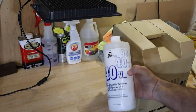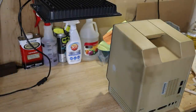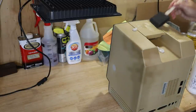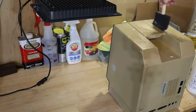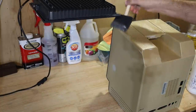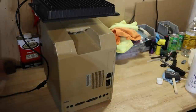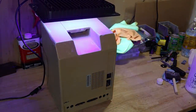The case is too large for immersion, so I'll have to use the cream method instead. I don't like this technique as much because it can lead to streaking and marbling. One way to mitigate that is to check on the part often, shifting or reapplying the cream as necessary. I'll tend to this about once every hour to make sure it gets even exposure. And because it's indoors, there's little risk of the cream drying out in an hour, so I won't be using any cling film.